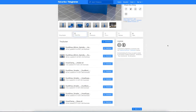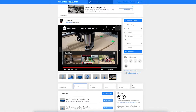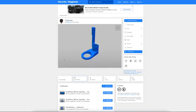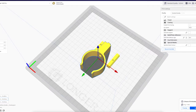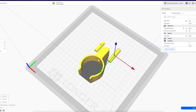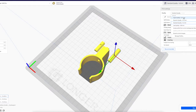There are a lot of websites with free or paid models available — I got all of these models from Thingiverse. It's a great community of people who put their stuff out there for free, and there's a ton of models on anything you could imagine. To get the model into a format that your printer can understand, you'll need to use some slicing software. I use Cura, which is free — it actually comes on the memory card included with the printer. I generally stick with the factory settings and adjust the infill, which controls how solid or hollow the model is, and turn up the speed a little bit.